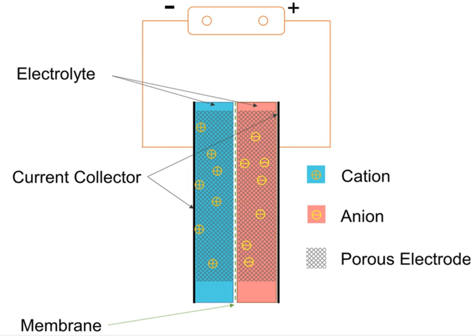Grid power buffer. A group of EVs and HEVs during their charging process draw very high current for a short duration of time, which creates power pulsation on the grid. Power pulsation not only reduces the efficiency of the grid and causes voltage drop in the common coupling bus, but it can cause considerable frequency fluctuation in the entire system. To overcome this problem, supercapacitors can be implemented as an interface between the charging station and the grid to buffer the grid from the high pulse power drawn from the charging station.